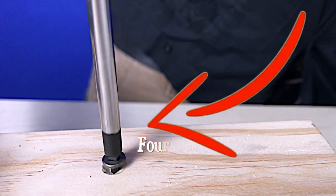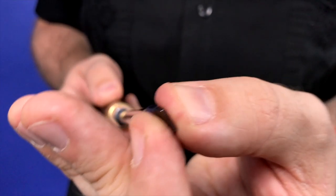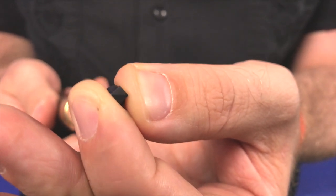It has four sides, so it gets a really solid grip and when you turn it, it doesn't slip out — thus negating the stabbed hand of good old Pete. What makes it brilliant is that it gives equal pressure on all four sides, rather than just the two opposing sides you get with a standard slotted screwdriver. With a standard slotted screwdriver you're only getting contact on two sides when turning, so torsion-wise and pressure-wise it's not particularly efficient. With the Robertson — or the Robbie, or the Bobby as my dad calls it — you have four surfaces all contacting and getting proper torsion. It's just a very efficient way of driving in a screw.